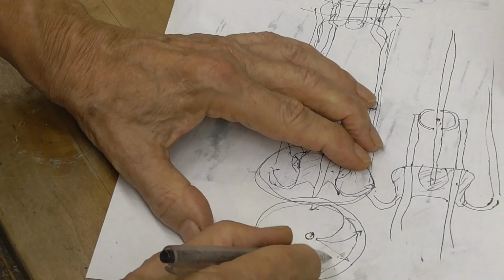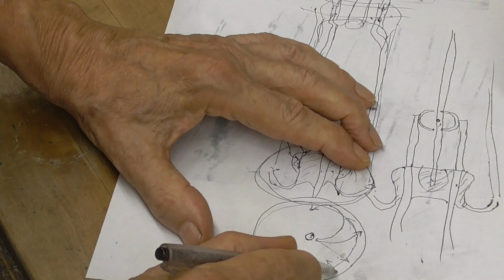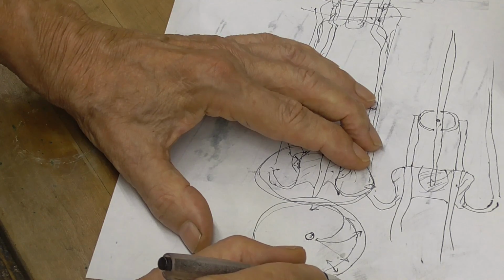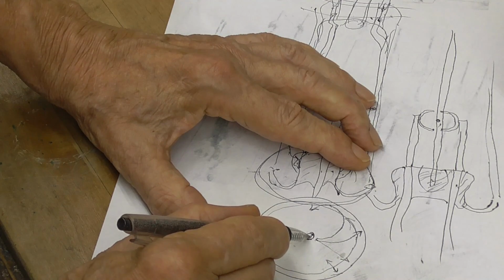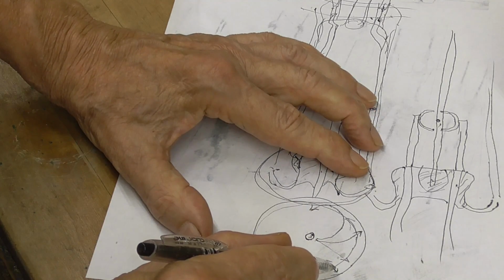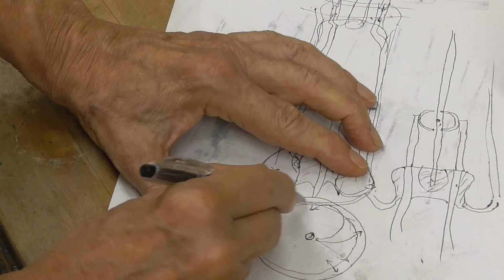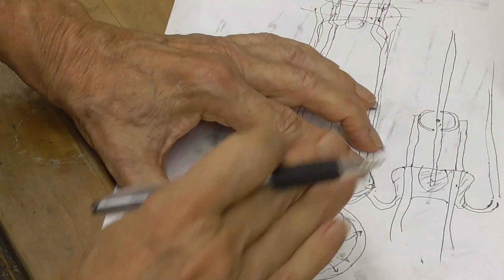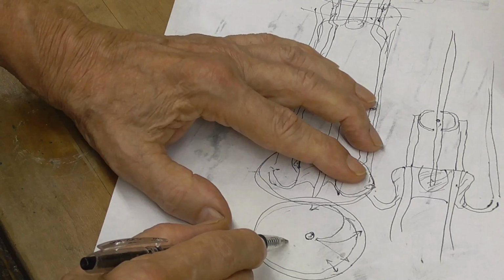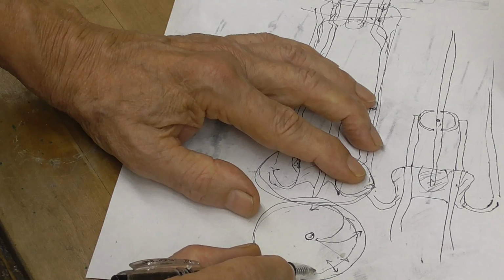The voltage will increase slightly, causing the field to move in, and it'll decrease slightly, causing it to move out, at which point the electrons will hit the plate, giving plate current, and that will increase the axial magnetic field slightly, and that causes the electrons to move back in and break connection, and they go in a circle again. And this goes back and forth like that at a microwave frequency, just absolutely unbelievably fast. It can be up in the gigahertz range.